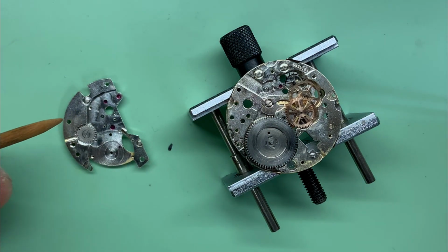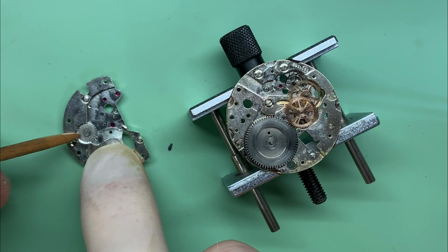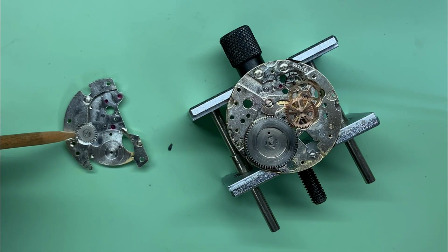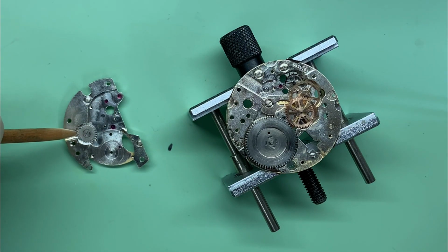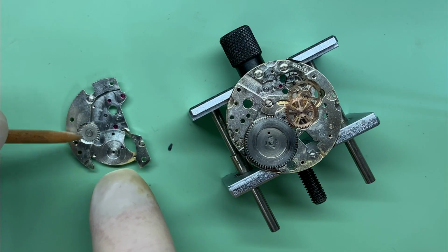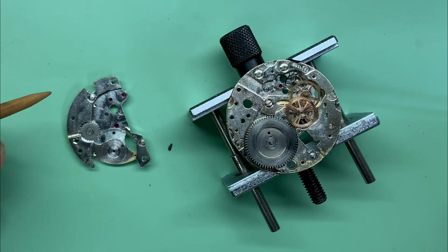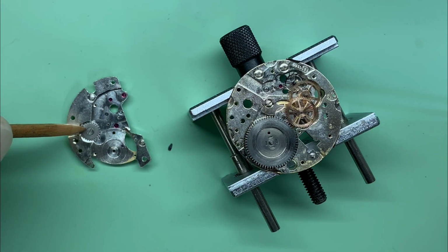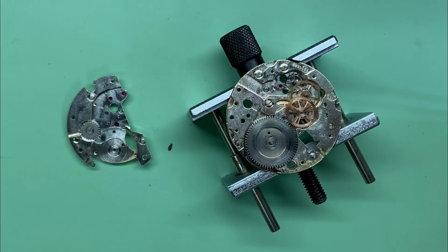So there we have it, the screw's tightened, and yeah, we're going to have a lot of play, look. Now that isn't natural. There's a winding pinion here, so when you turn the crown, it would wind this gear like this, and then that winds the barrel in turn. So with it being a bit wobbly, I'm not sure, it's probably bind rather than actually turn properly. There's nothing I can do, and for the sake of the video, certainly right now, let's continue.